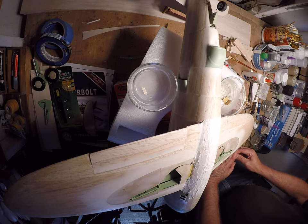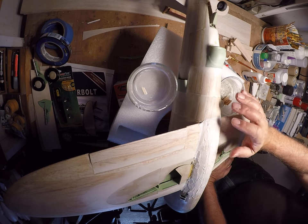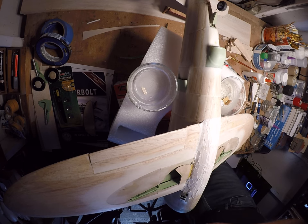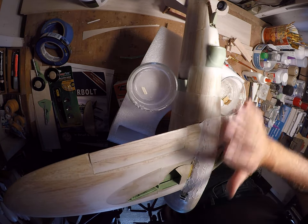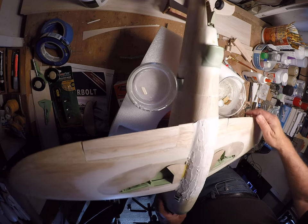What you want to do is check it with a fine grit — about 180 grit — and just sand lightly. If you see any tearing of the spackle, if it starts to rip instead of sand, you've got to stop — it's not ready. But if you get that nice dry raspy sound and it's just powder coming off, then you know it's good to go.